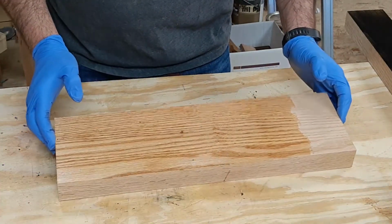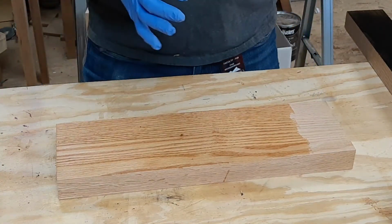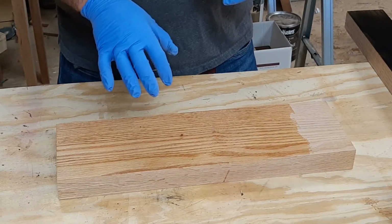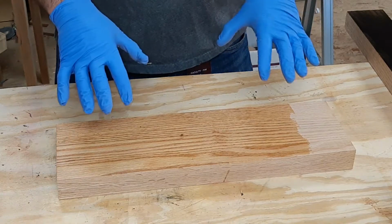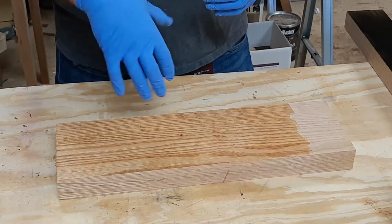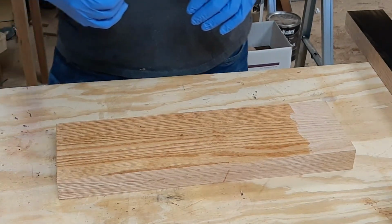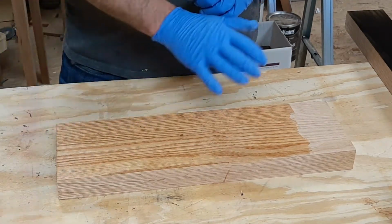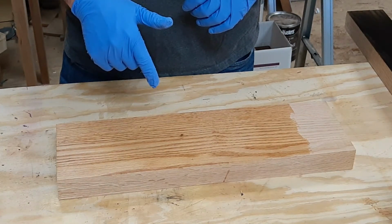I should say that this process, while this is drying, and we're almost there, I've seen this a lot in work from the late 80s and up to early 2000, where gesso, so it's a white gypsum material, artists use it for preparing canvases before they would paint. You can put white gesso in here. They also sell black gesso, but you can also affect that color and add pink or purple or whatever gesso just by mixing pigments or dyes to that gesso product, and then put it into the pores here, sand it smooth. This chemical, as well as the vinegar thing that we talked about, will not react with that gesso product.